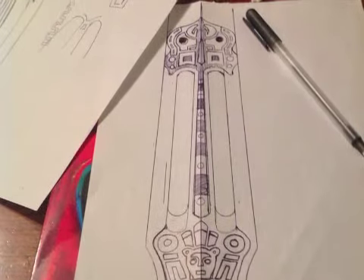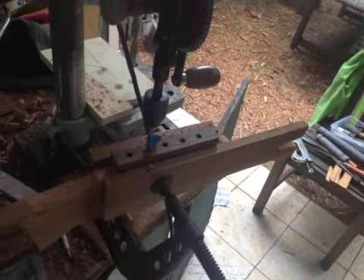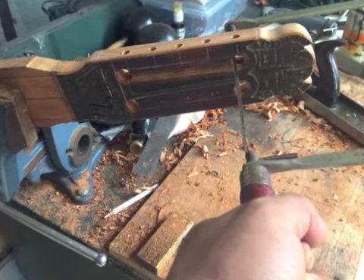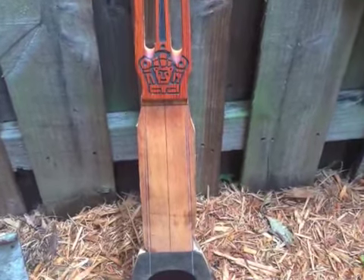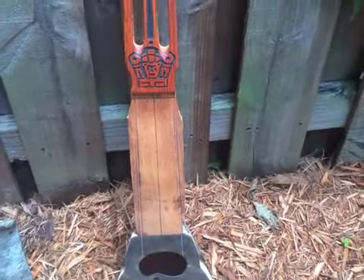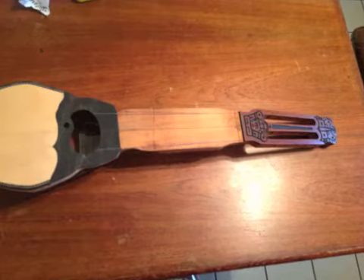Here's the design that would be carved onto the headstock. Here's a piece of cocobolo being glued to the headstock. We are drilling the holes to receive the tuners, cutting out the channels, and finishing the headstock. Here is the headstock already carved and finished — or semi-finished, as you would say. There will be minor adjustments later. Here you see it very close to its final state.